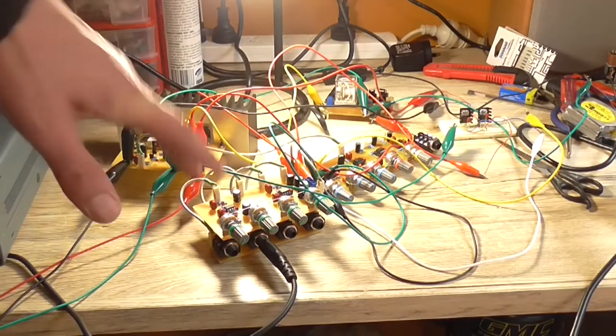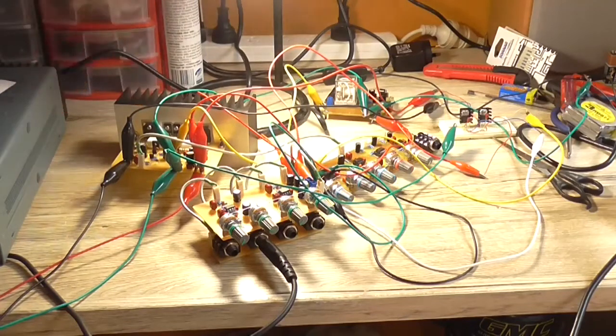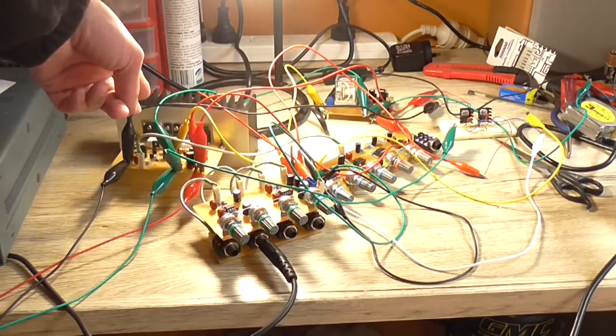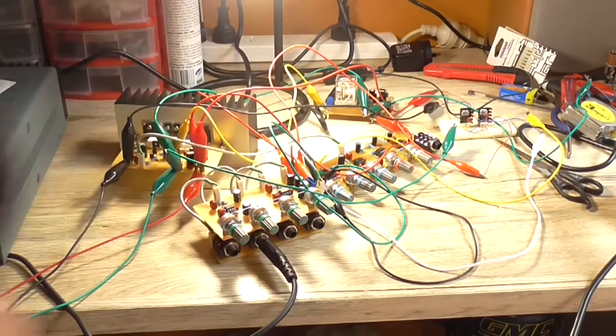We're looking at this mixer preamp and, well, we're going to call it now a 4-channel mixer amplifier because I've now got the 25-watt RMS. I've got to stop saying that. 25-watt average and about 50-watt max power amplifier module here sitting on the desk connected to a speaker protector unit, only because this makes a huge thump when you turn it on. Plus the mixer is also connected to the input of the power amp. So the only thing missing out of this whole entourage of components is a power supply module.